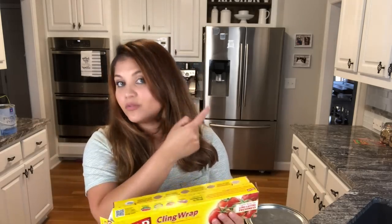I do the same thing for the outsides of the cabinets — once I flip them over, the label tape is on the underside that's already been painted. I paint one layer in the morning, let it dry all day, then come back in the evening and do my second coat. I let it cure all overnight before doing anything the following day. Also, since you're going to be painting several times with the same paint, you don't have to clean out your tools every single time. What you can do is take your roller, wrap it up in cling wrap from your kitchen, wrap it up really good, and put it in your refrigerator — it definitely preserves it, keeps it moist and ready for the next application. This allows you to save a little money.